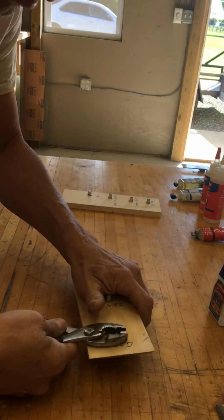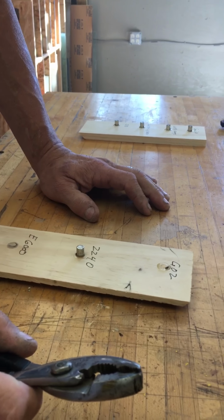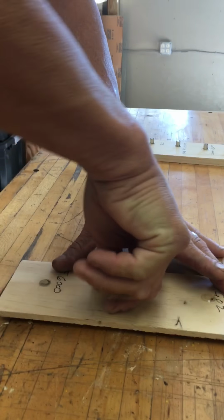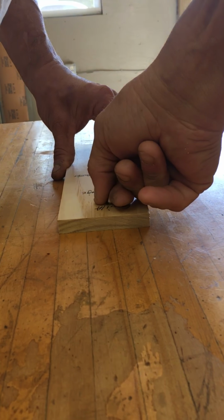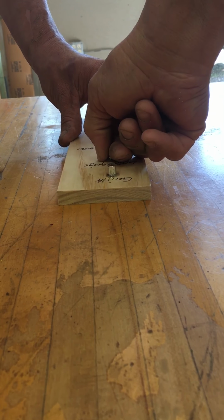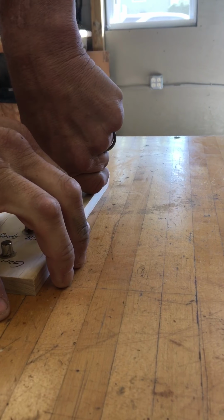Now, do you want to also see if by putting a little bit of torque on each of them that now they would give to just your hand pull? A pull, yeah, I can do like that. To see if there was any weakening? Okay, so that solder bond's pretty darn good. Gorilla Glue? Nope. The Loctite? Nope. The large bottle Loctite? Nope. And the JB Weld.